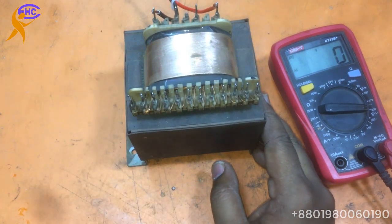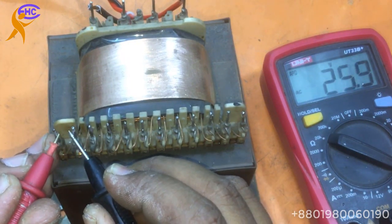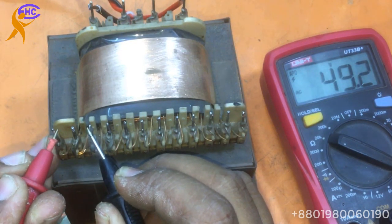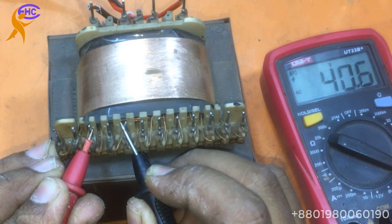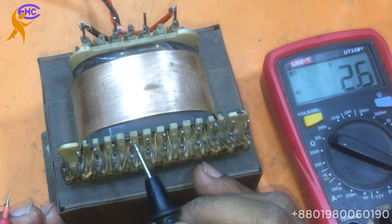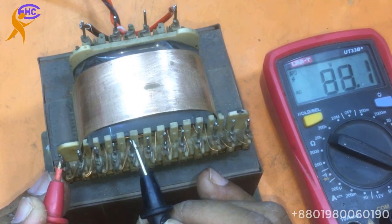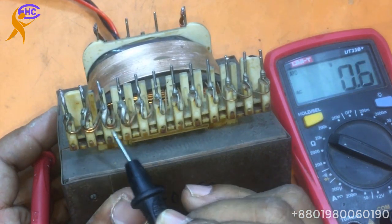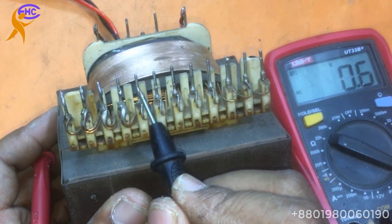This is 25 voltage, that is 49 voltage, that is 23, that is 49. That means this middle one is the ground. I've got five wires — one, two, three, four, five. This middle one is for ground, another two for low voltage, and two corners for high voltage. This middle is the ground, the two corners are low voltage, and the other two corners are high voltage.